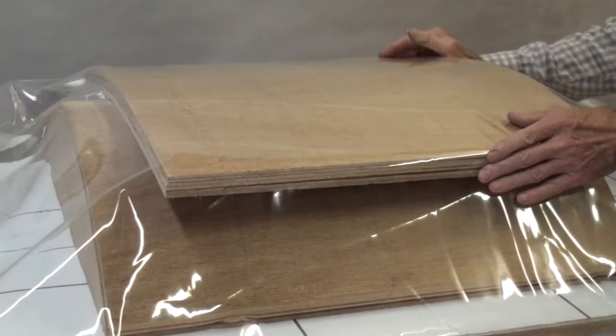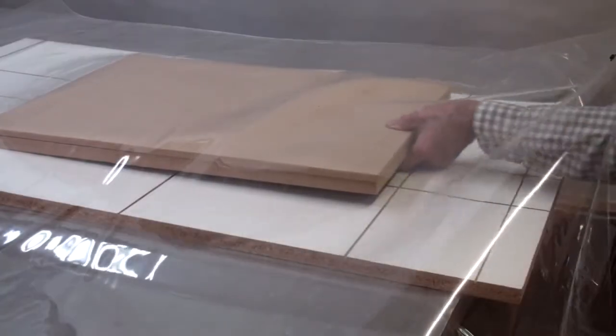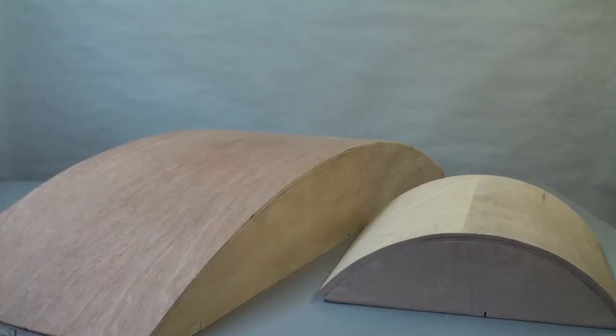So the question is, how fast do you really need to pull the air out of a bag? That depends mostly on the glue you will be using — it's all about staying ahead of the glue's tack time more than anything. Having the pump suck the air out super fast is not always a benefit. It's quite useful to have a little time to adjust your work through the bag while the pump is removing the air. The other factors are how big the bag will be — the bigger the bag, the longer it takes — and whether it will be used mainly for flat work or curved work, especially large curved work. Curved work adds to the evacuation time exponentially depending on the size of the curved form.